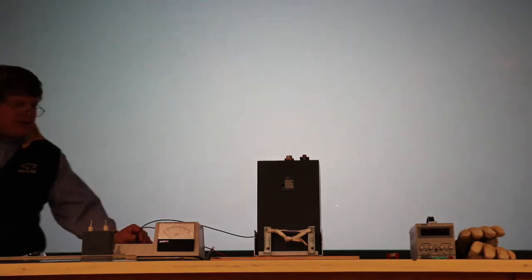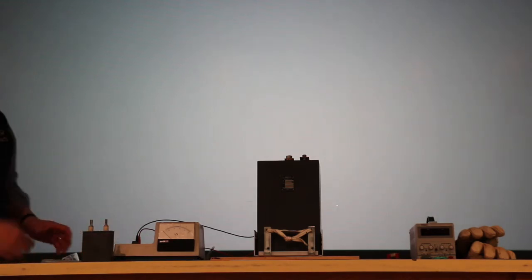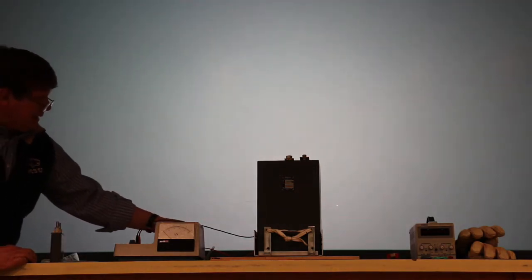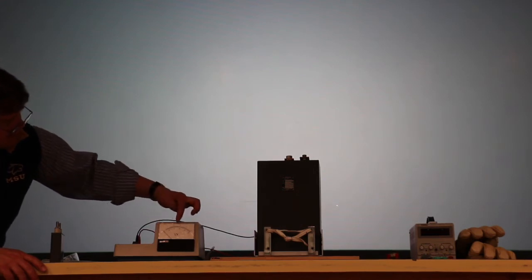I truly apologize. But we're going to raise that to 3,000 volts, and it's going to take a while. It didn't take nearly as long as it normally does in the last class, and that's why I suspect that one of them is damaged. But for people in the front row to watch this gauge, I'm now using the top scale, and when it gets near 3, you gotta wave and get my attention and get me to turn this off, because if it gets past 3, we destroy the other one as well. Okay, so let's talk about capacitance.